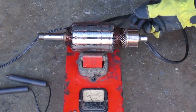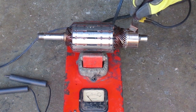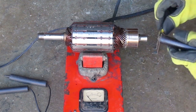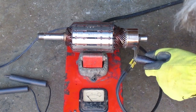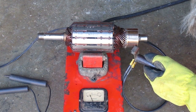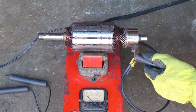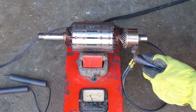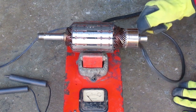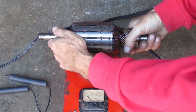There's my number again, so I've checked every coil and it's good. Just for fun, if you look around on this commutator you'll find that the same readings can be found on the opposite side — so this magnetic field is producing voltage in two coils on opposite sides of the armature. This armature passed every test I could throw at it. I'm going to use it.